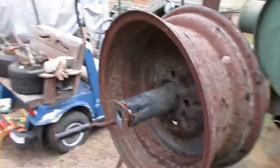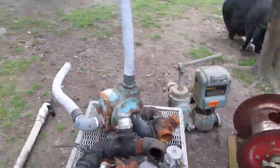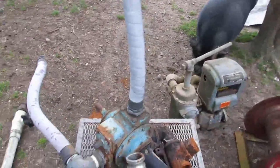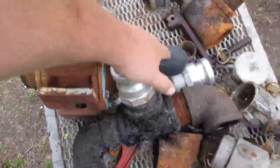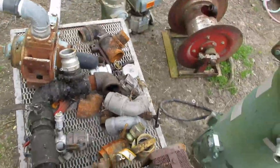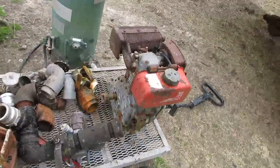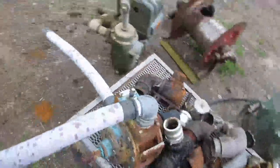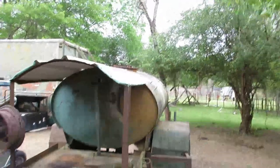That's coming off. My plan is to mount on the front - I've got a Yanmar diesel that runs 3600 RPM and a Blackmer pump that runs 500 RPM. It actually has a shaft on either end so you can run clockwise or counterclockwise. I'll need to get a gear reducer because it should run between 520 and 640 RPM. This is the pump that came off that fueling truck - it'll go through the filter, through the meter, through the hose reel, and into the trucks. It's raining so we'll see when we can get back to it.